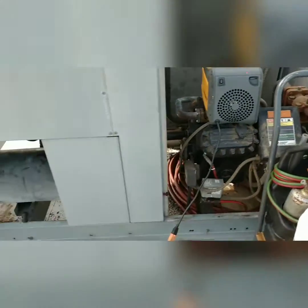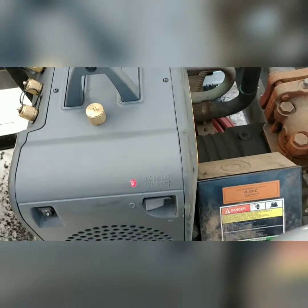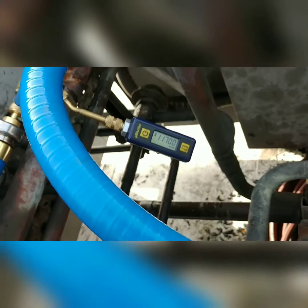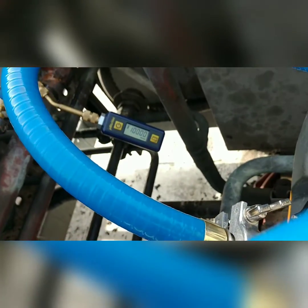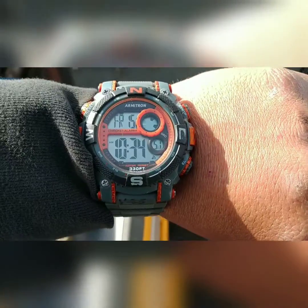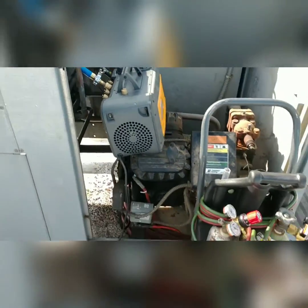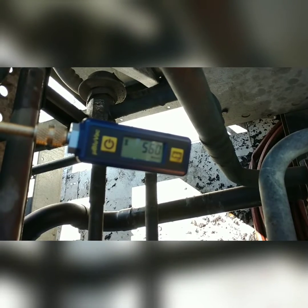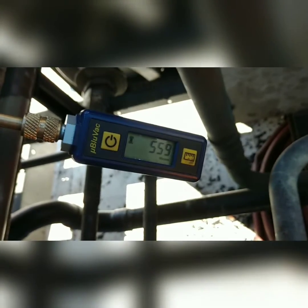Once that reaches about 10,000 microns, according to Mr. Jim Bergman, I'm gonna close that gas ballast. So right now it's 10,000 — now 680 microns. Been on the vacuum for a while now. There it is — 569 microns.